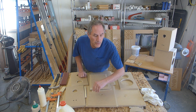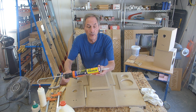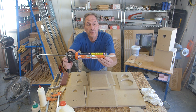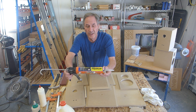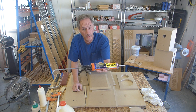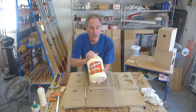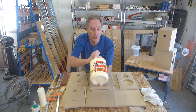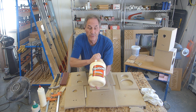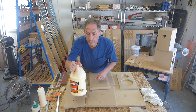First I'll cover the two glues I'm going to use. This is PL Premium, a high-viscosity polyurethane construction adhesive — not typically used for stuff like this, but there's one place where it works really well. This is Titebond 1, or original Titebond — really high quality glue. I've used it for years and there are probably others that work fine, but that's what I'll be using.